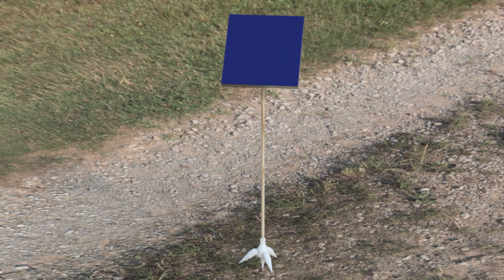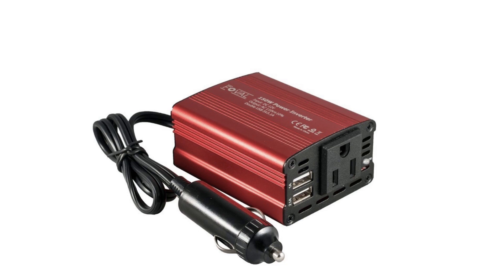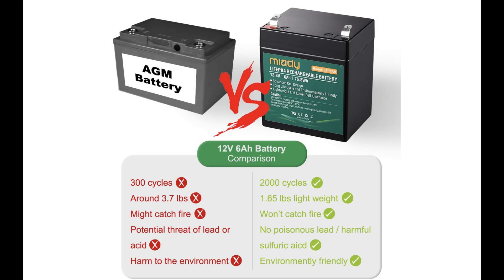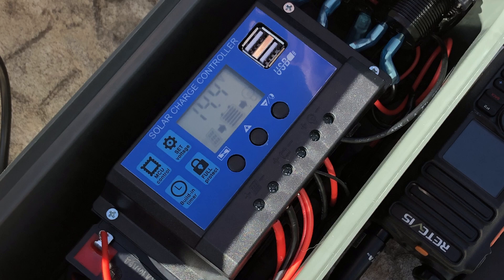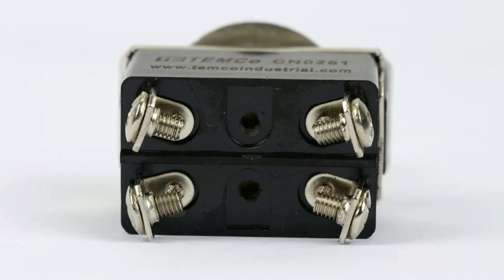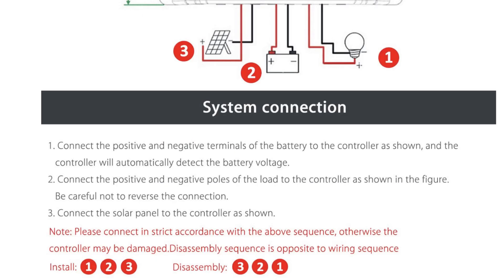For future upgrades I'd like to design some kind of stand for the solar panel. As you can see I've designed some kind of pterodactyl claw-looking thing that doesn't really work and just falls over. If you wanted to plug in any 120-volt AC appliances you'd need an inverter, which is pretty cheap — about $15 on Amazon. Another upgrade would be replacing the lead acid battery with a lithium battery, which has more cycles, is a lot lighter, but is a bit more expensive at $30 versus $19. The charge controller's display is always on, so even when the solar panel isn't providing electricity it draws power — to fix this you need a double-pole single-throw switch to cut power both from the battery to the charge controller and from the solar panel to the charge controller, because if the battery is disconnected but the solar panel is still connected it'll damage the charge controller.